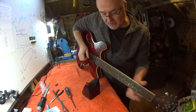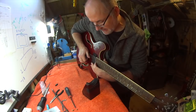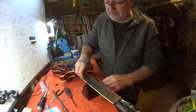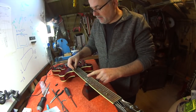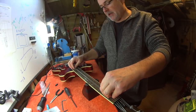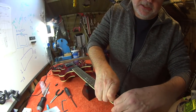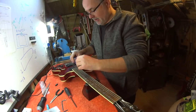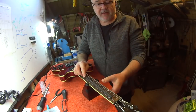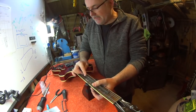What it's revealing pretty quickly is the extent of the previous leveling, and that's really good. Now what I'm doing now is I'm recalibrating to make sure that I've still got the right curve as we go across the neck relief, and we do, so it's even. It's not often the case. It usually changes as you go across the radius from one side to the other. You'll get more or less relief on one side of the neck than the other. But this means that my tool can stay adjusted the same.